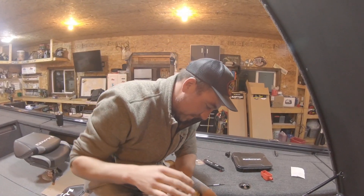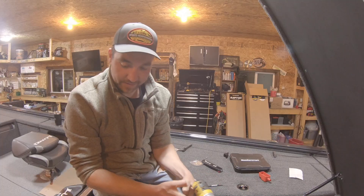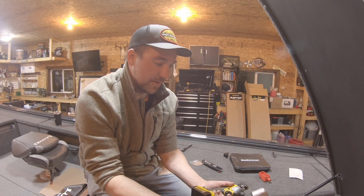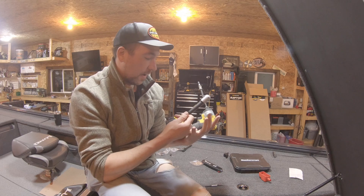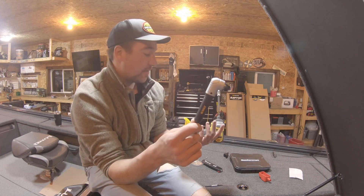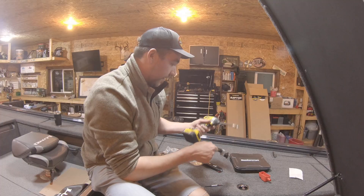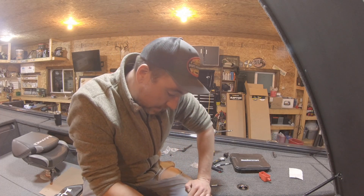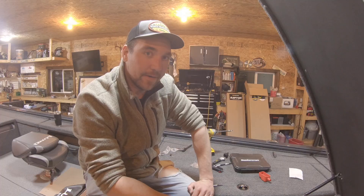Just repeat that process until all the terminals are on. Every battery's got some form of trolling motor wire on it, or a jumper, and a charger on each battery. The numbers on the charger all coincide with the numbers on the battery. Straps are on, everything's as organized as it can be. That was the hardest part of the whole process — mounting that onboard charger. It should have been the simplest, but because of the way it laid, I had to get extension bars, flexible extensions, and the right angle attachment. Those three tools can get you through any nightmare scenario like that — definitely good to have around.